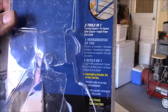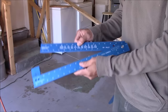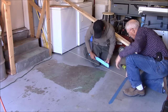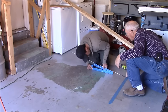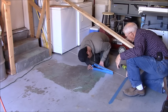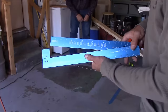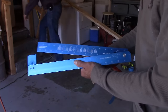To measure the angle I'm going to use, I'll be using a folding framing square — about a $20 tool you can find at most hardware stores. This tool adjusts at different angles to let you measure a wide variety of angles. I'm going to pull the string nice and tight, hold one end at the 8-foot mark and the other at the highest point of the ramp, and carefully measure the angle with my folding square. If needed, you can put a piece of tape on your framing square and mark it with a pencil to keep your angle perfectly marked.